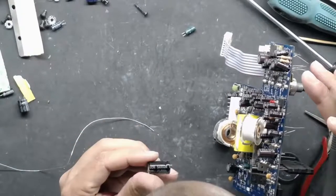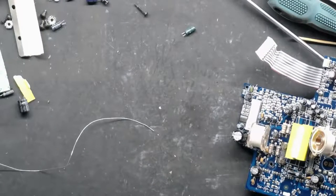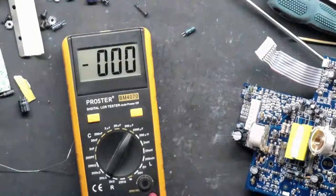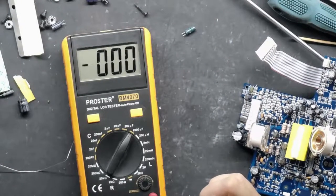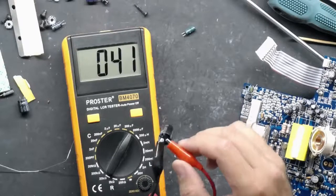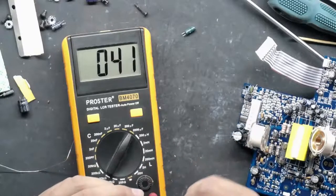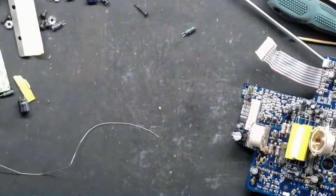This one does not look like it was leaking. I'll check another one just for the heck of it — this could have been all power supply caps. Nope, that's good. It's reading 41–42 on a 47uF cap — that's a good cap. Let's see if we have some of these; we need 47uF at 200 volts.